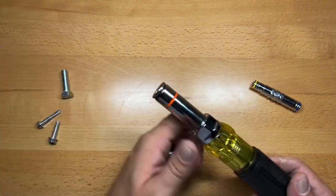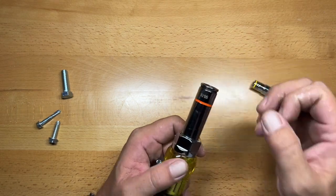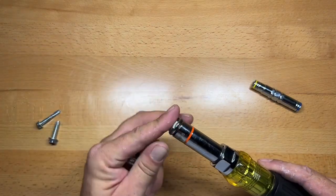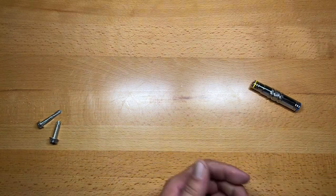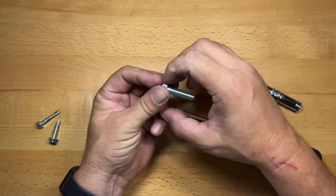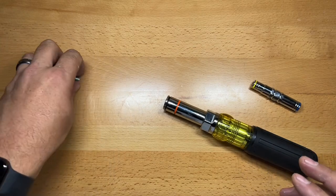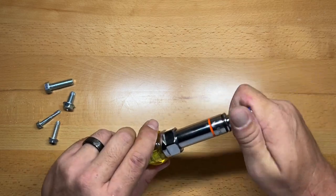Seven sixteenths is not one that I use very often. Nine sixteenths is a driver that I use a lot, but it's not a deal breaker for me that it doesn't have a magnet in there. I actually like the fact that it doesn't, because when you have all-thread with nuts going through them, the ability to have that deep set allows you to get down on that nut that's on the all-thread. So it's kind of great that this one doesn't have a magnet, and then everything locks back in place nice and simple.